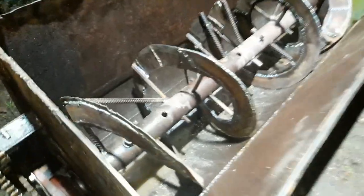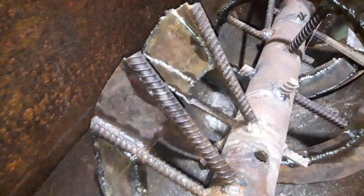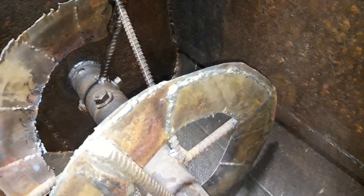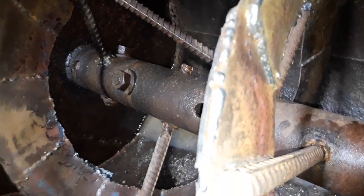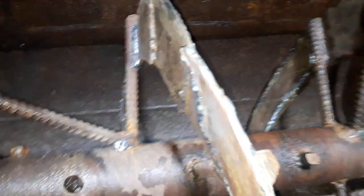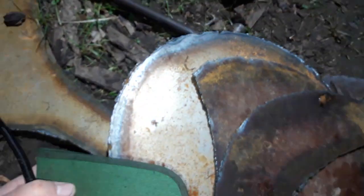So the shaft we have is pretty big and pretty strong I reckon. We use steel parts to make it stronger as well, otherwise they're gonna probably bend one side or another. If there's gonna be some stoning it should still be strong enough. I reckon the bucket thickness we have is about 5mm and we've been using 2.5mm steel, cut out with this tool. Of course the quality probably is not the best, but this steel will do the job.